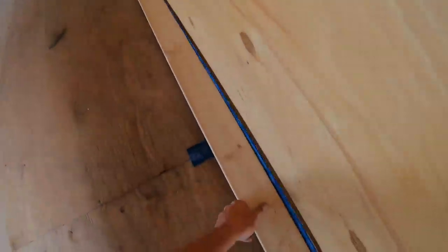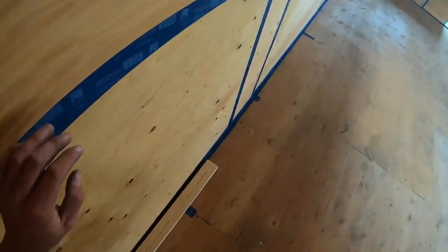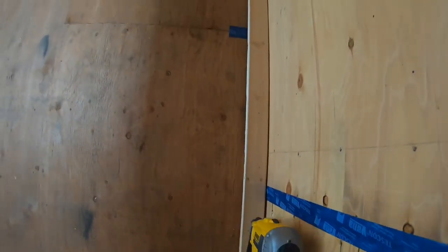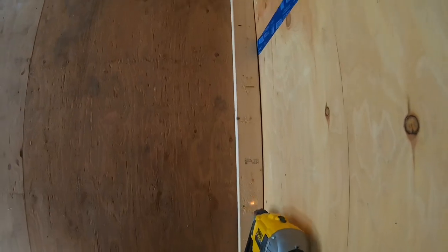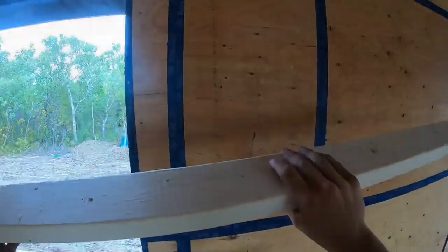This is real-time footage of us starting the framing of the interior cavity — the wall that will be used for running the electrical and plumbing. This wall will get insulated with batt insulation, not blown-in cellulose, so it'll be an extra layer of insulation. A lot of houses are only a two-by-four wall, but this two-by-four wall will essentially be just an extra add-on for running insulation.